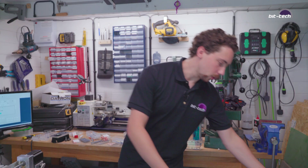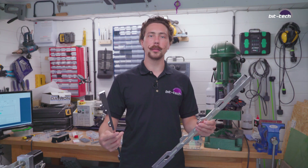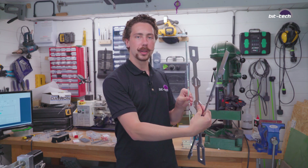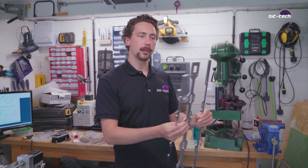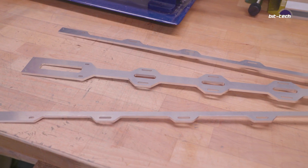In addition to those we've also got the front radiator mounts. These have been done a little bit differently because I didn't want to waste a huge amount of aluminium on these, so they're done in strips. This is all 5mm aluminium — these are going to be attaching directly to the radiators and held in place, and they've got part of the modding cubes which are 12mm threaded standoff cubes holding the whole thing together.